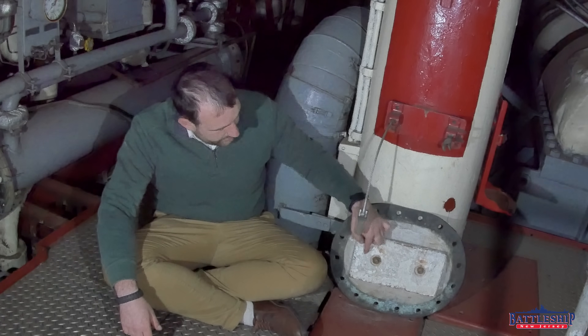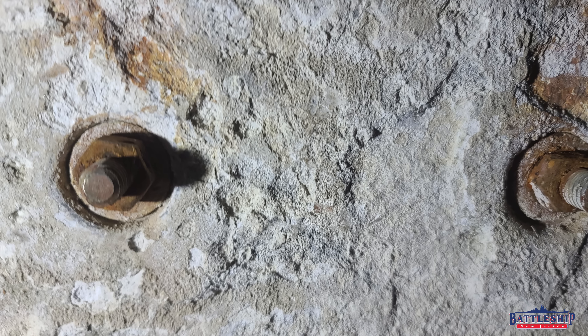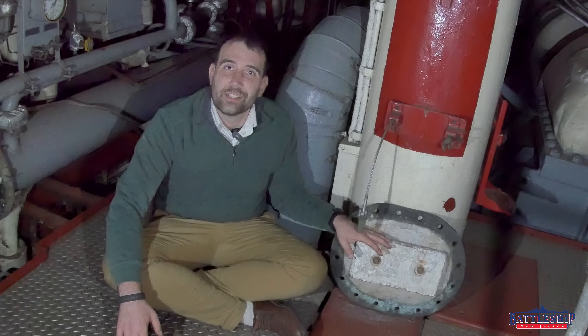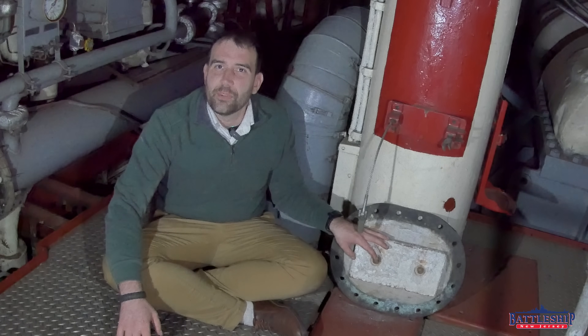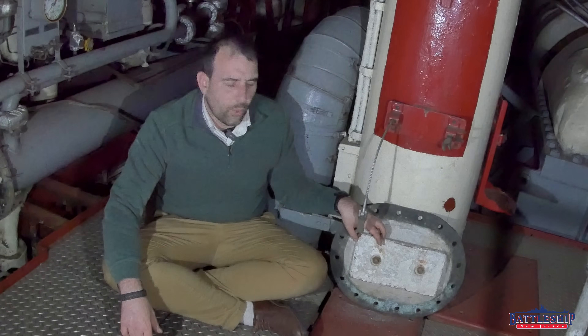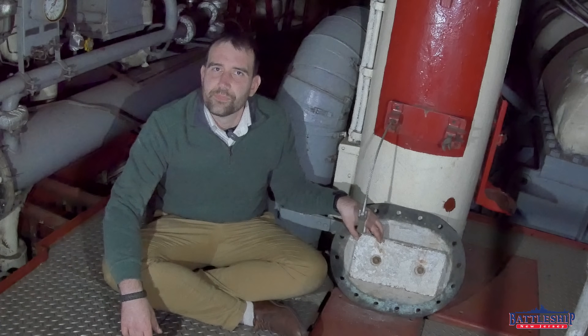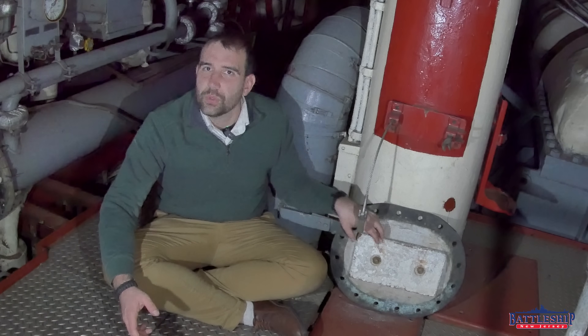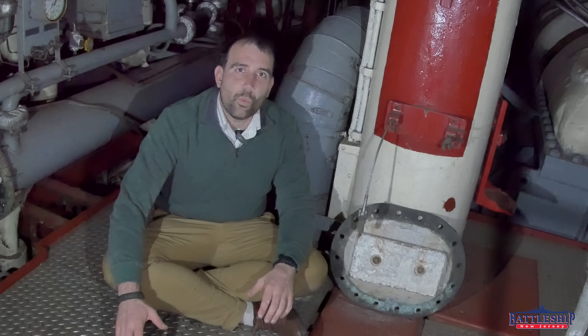You can tell that the zinc is much more pitted and corroded — the white dust is the byproduct of corrosion, the equivalent of rust on zinc. That is our current passive system. The problem is the ship was mothballed in Bremerton, Washington, in salt water, so they used zinc. In fresh water you might use magnesium if it's truly fresh water; aluminum is also common in fresh and brackish water. We've had divers down to look at the ship, and they have reported minimal corrosion of our zincs, which means they're not working — probably because we're sitting in fresh water. So we definitely want to remove these and replace them with aluminum anodes when we go into dry dock.